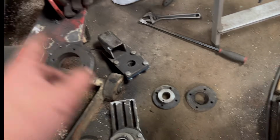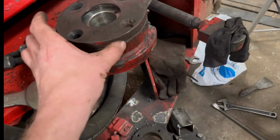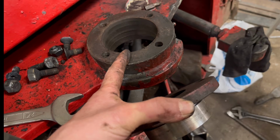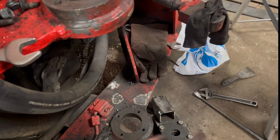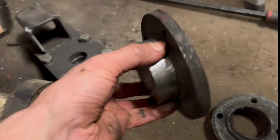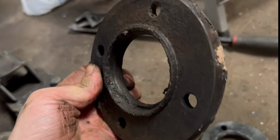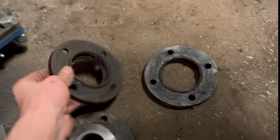So now what I've realised is that these caps for the top are bigger than the ones from the bottom, because they're 55mm OD. No, it's not. What is it? That's an 80 OD and that's a 75 OD. So these caps are different. So I've got one that will fit there. That one that I put in, I've realised now that's another top one, so that won't fit in the bottom. But then these bottom ones are that badly worn that I can't do anything with them. That won't fit in there because of that, worn and knackered, both of them.